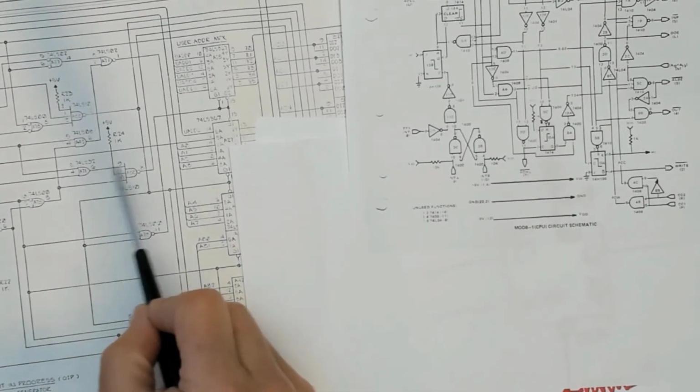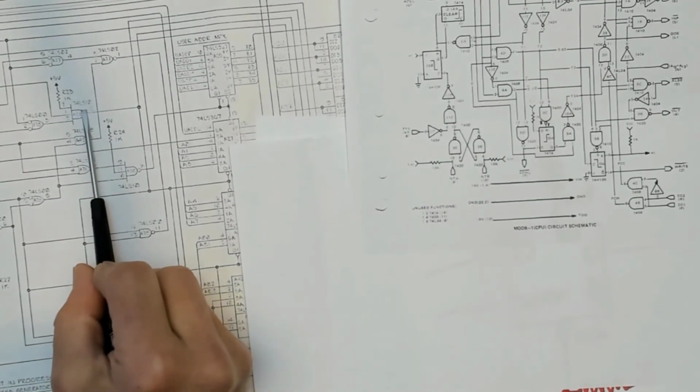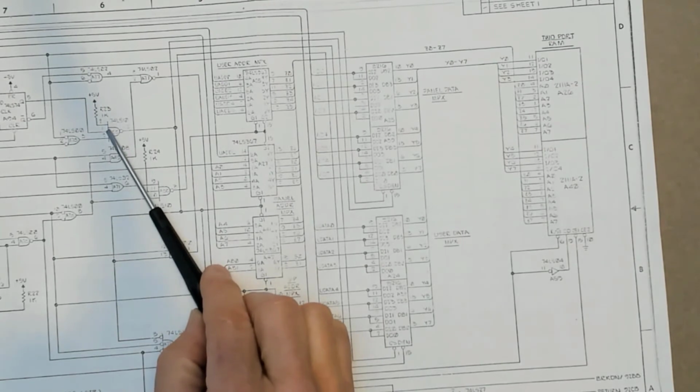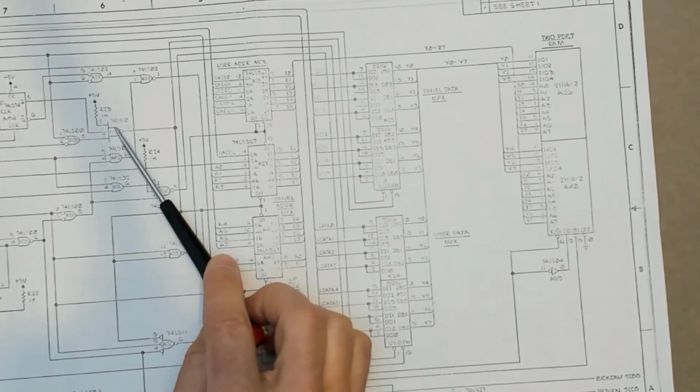And technically, these wouldn't have needed that resistor because these were from the 74LS family, and as we talked about in the last video, the LS family had outgrown the need for these current limiting resistors. So presuming that Intel is not going to spend money putting in any resistor that isn't absolutely needed, or at least useful, what gives with this design of the NAND gate?